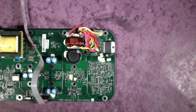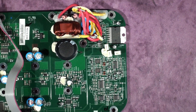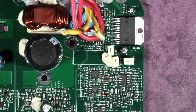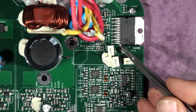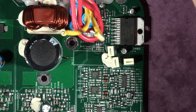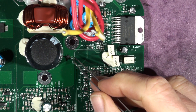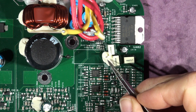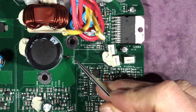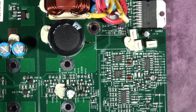What's happened is here — you can see these two little wires down there, you can just see the ends of them. I wanted to show you the actual resistance — it's quite interesting because it's a white 5 watt 10 ohm resistor that sits on these leads. Clearly the vibration from the speaker has caused fatigue of the leads and one end is blackened. I'll just go into tele-macro and see if we can see that.